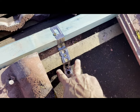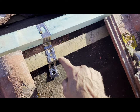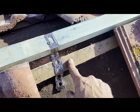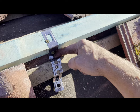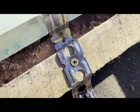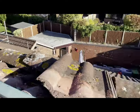This is being fitted directly over a rafter - there is a rafter right here. The felt sags down slightly but the rafter is solid, so that screw is going through the batten into the rafter below, with another screw pinching it either side into the top of the rafter. If you're doing the retrofit this way, make sure this piece goes straight down the batten because the nibs on the tiles that hook over the top of the batten might get in the way, so you need to flatten that down so the tile sits right.